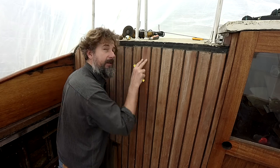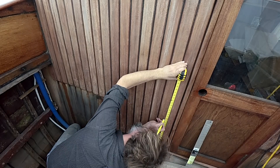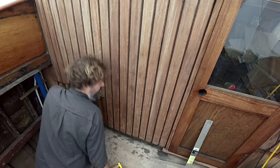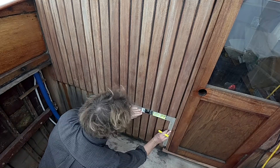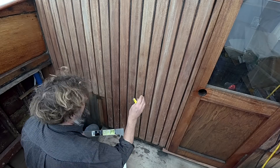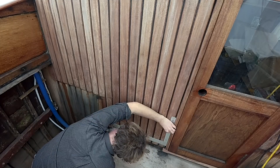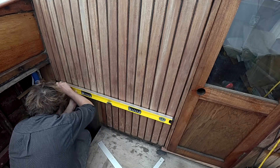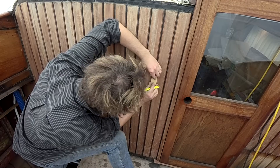Probably plugs just to be sure they're protected. So, an inch and a half from the bottom, then 16 plus an inch and a half, and the top one is basically right at the top of the board. I'll project these out with a square — though on a boat, what is horizontal or square to anything? I'm doing all this work before I finish-sand, so it will sand off all my pencil marks and I'll be able to sand the plugs at the same time. Now it's time to take my little marker and mark both sides. I can see exactly where I'm going to go.